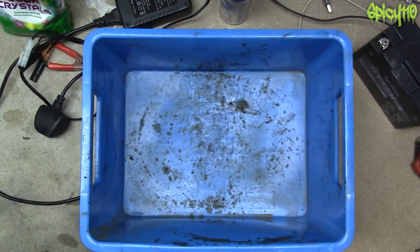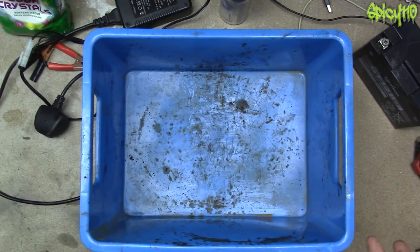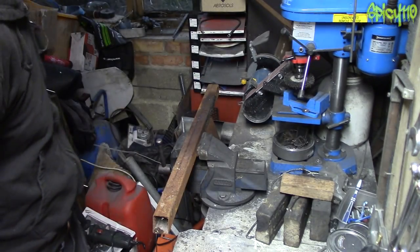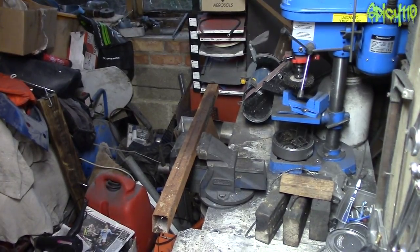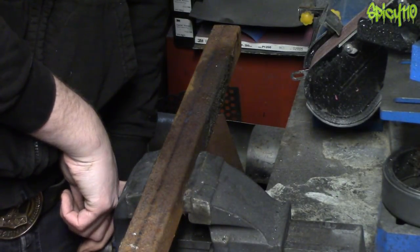It does need to be sort of even around the area. Then you need some non-conductive thing to bridge across the top. This is mostly going to be just testing the setup, but if it works it won't need much changing. First thing I'm going to do is just buzz over this with a wire wheel and get the rust off. Remove the tank of thinners from where I'm about to start grinding — can I give you more zoom? There you go, a tighter shot.